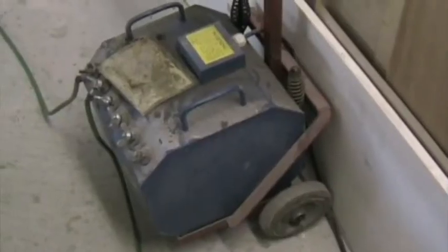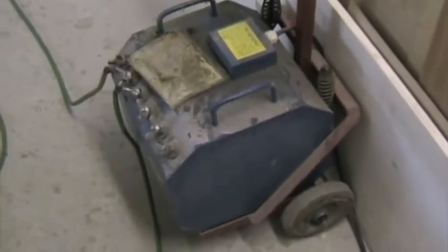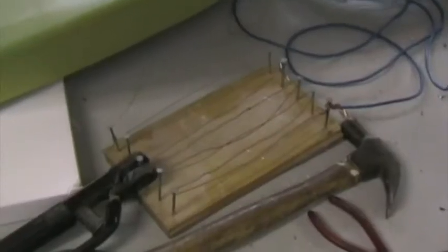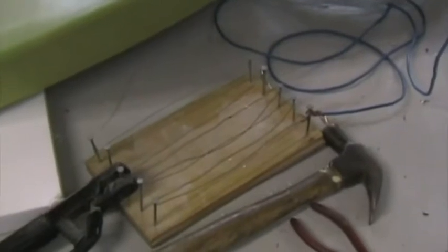Once this step is done, what was the convex side is now on top and it is now perfectly flat and the block is 225 thick. We turn it over, reset the hot wire to 220 and then make the final trim to 220. That way both sides of the block will be perfectly flat. For a hot wire power source, we're using a normal arc welder set onto high, and to regulate the temperature we've got a bit of stainless steel locking wire set up on this resistor block here and we move it as required to get the right temperature.